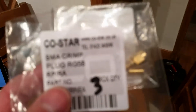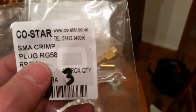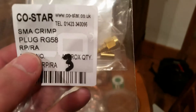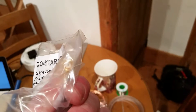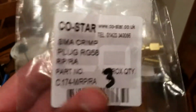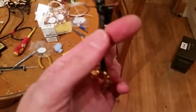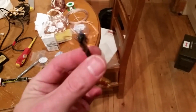The last thing you'll need is some SMA connectors — different types. I'm making these for the Boss Cam transmitters and they need a reverse polarity SMA on the aerial side. You can see the part number there. You can get these straight, which are difficult but cheaper, or right-angled which are cooler but heavier. You should be able to get a bunch of these for about a quid each, and out of these bits you can make like 20-30 aerials.